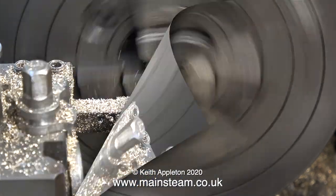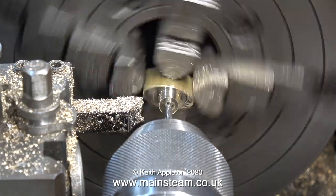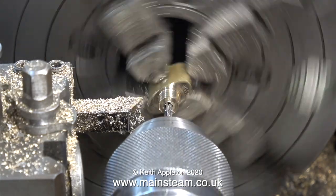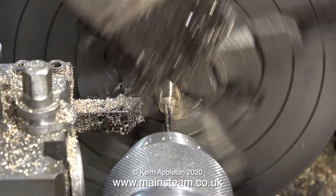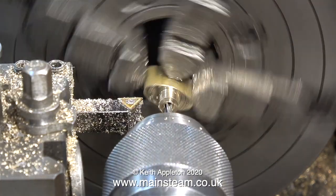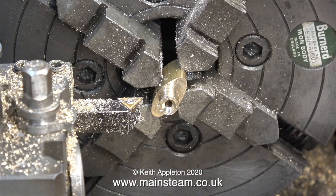After drilling the hole, I introduce the reamer with the lathe running in back gear, because you always need to ream things quite slowly. I'd like to illustrate a point here — you're not supposed to move the reamer backwards; I was told this by a viewer who took the time to write in and tell me. But I am moving the reamer backwards periodically to clear the chips. If I carry on without doing so, the reamer will snap off. You can hear by the sound of it when the chips are starting to jam up, and if this was phosphor bronze the reamer would have snapped off by now. The final job is the small countersink in the end before parting it off.